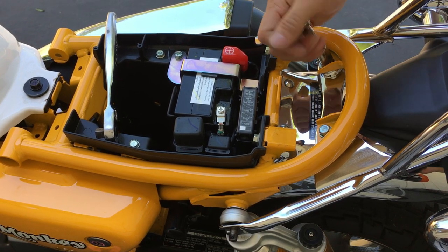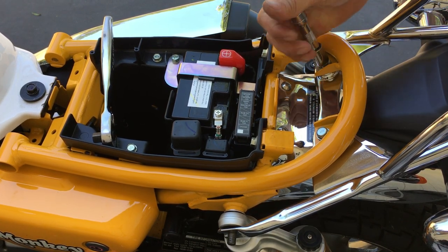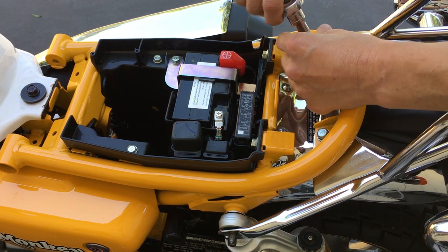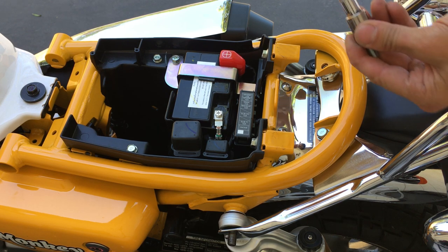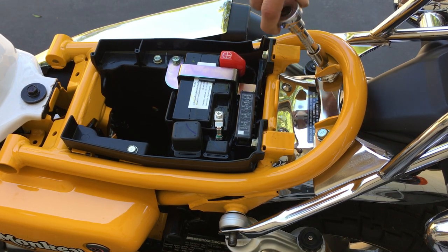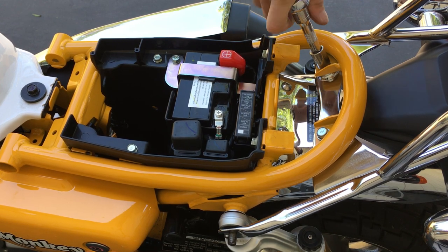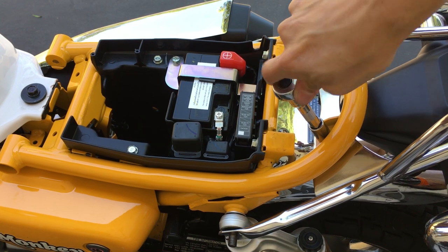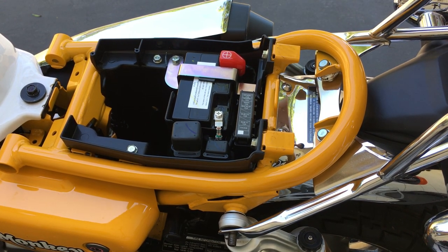Maybe if you use a really thin washer it'll probably still be okay, cause you're not putting that much weight on this. If you're putting three kilograms on this, you could use the washer and it'll be fine. But if you put a little bit more weight, you might not want to, just because with the washer you have less thread interface. The less thread interface you have, the less strength you have. So you want it to be as strong as possible - more thread interface. Once I tighten it down, the bolt will actually be flush on the bottom. I'm good here.